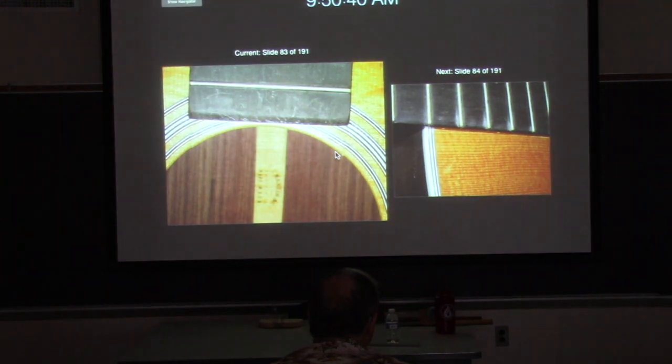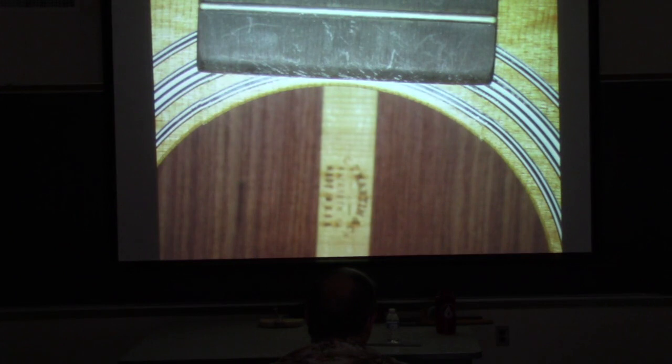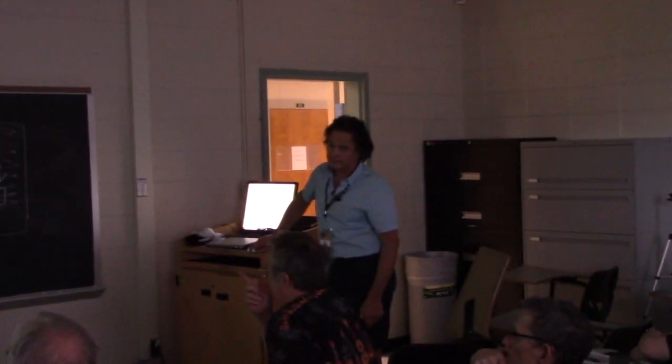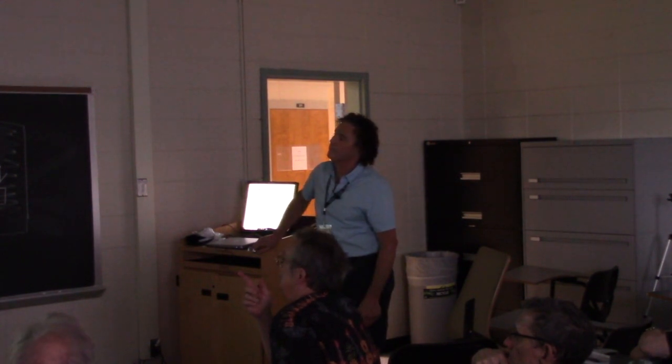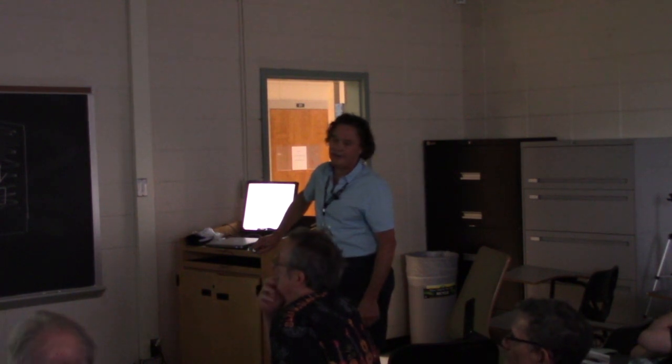What I tend to see is the cracks always occurring right along the fingerboard itself. So that kind of leads me to believe that maybe it could have been a scoring issue. I think too, because of the shrinkage differential between the spruce and the ebony. Because it's definitely more pronounced on ebony guitars than on rosewood. Yeah, I'll definitely give you that.